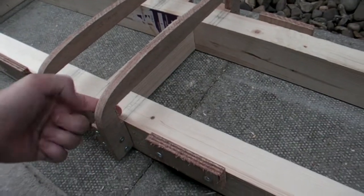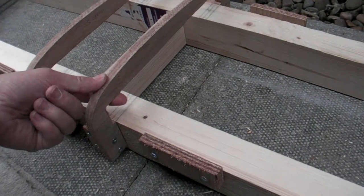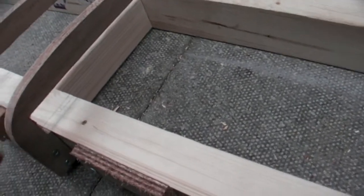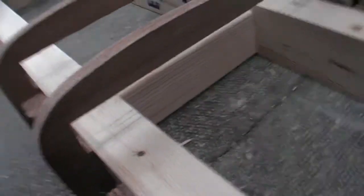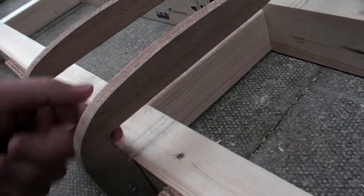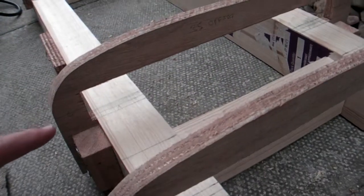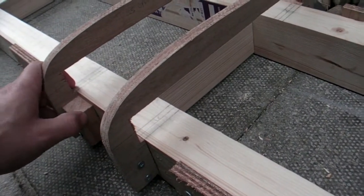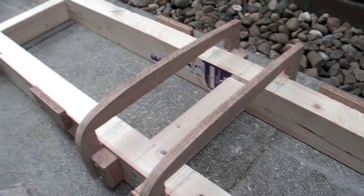The critical part is that the height between there and there is what I need to fit my board through, which is 32mm thick, but my leeboard is actually 25mm thick, and so this is the line here for halfway up. So this is the profile and I've got my 35mm offset, so the cutter will come in here 35mm machining the profile, and these bits of wood set the board — which is my raw material — central on the jig.